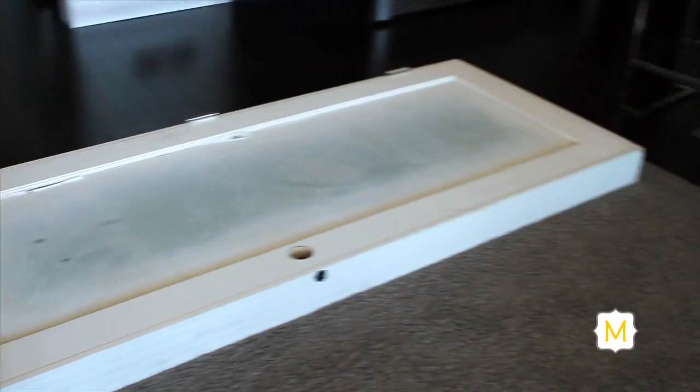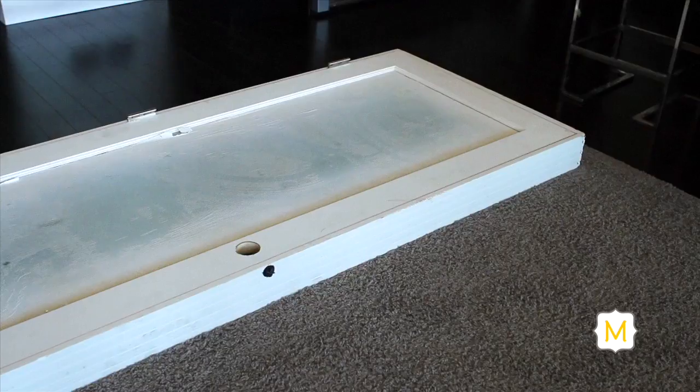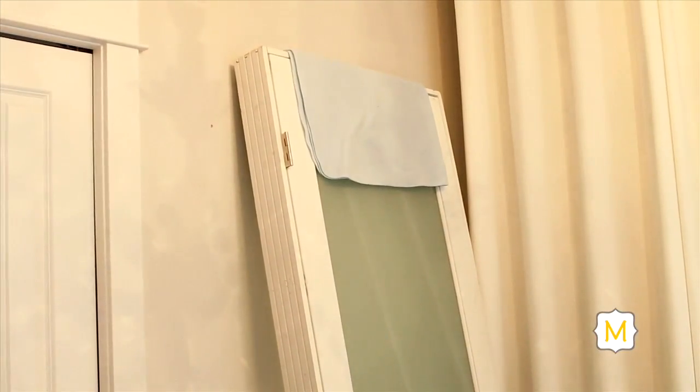So what are the first steps? First, we need to bring the door within the room to acclimatize it. After purchasing your new door, bring it home and acclimatize it overnight. This allows the moisture content in the door to match what you have within your home, and will avoid any swelling, warping, checking, or cracking that you may have if you install it too quickly.